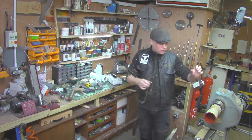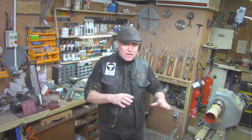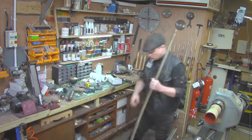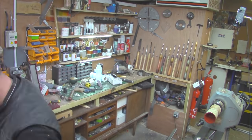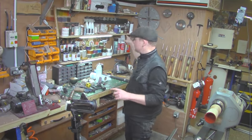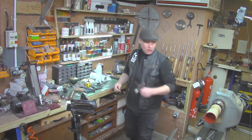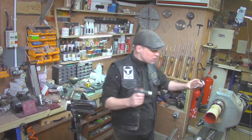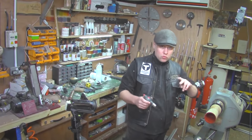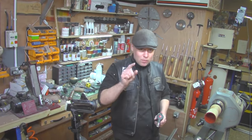Now we're nearly ready to start burning this piece. Before we start using any kind of fire in the workshop, you've got to make sure your lathe is clear of all shavings — above and below. The lathe and lathe bed are clear. Everything's dust free and I've left the air filter running to clear as much dust from the air as possible. Also make sure you have fire extinguishers to hand just in case things get out of hand. And if they get really out of hand, make sure you've got an escape route — I've got two doors in the workshop. Most of all, just take care, but have fun with this too.